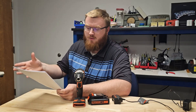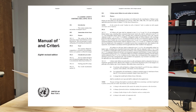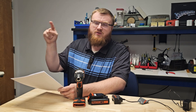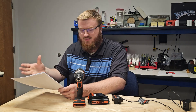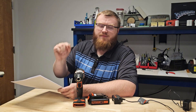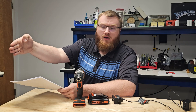Let's go through what transport testing means for a battery pack in the United States. You can follow along with the United Nations Manual of Testing Criteria — Revision 8, Section 38, Subsection 3: Lithium Metal, Lithium Ion, and Sodium Batteries. There are eight different tests, T1 through T8. For rechargeable batteries whose cells are already tested, you only have to do T1 through T5 and then T7. One important note: T1 through T5 have to be done in order on the same pack.